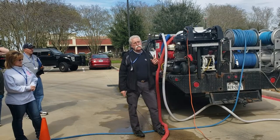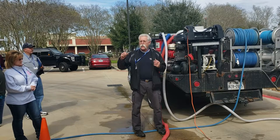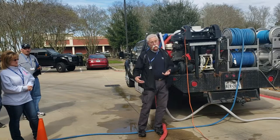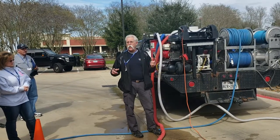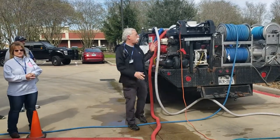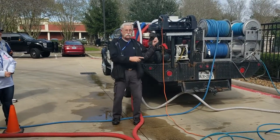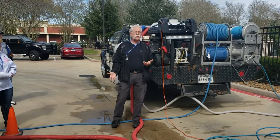There are situations where you want to suck water uphill — maybe drop a hose into an elevator shaft and suck water out. That's suction lift, and the harder you make that vacuum suck, the harder the pump out has to work. So there are times when you might want to take your auto pump out tank and put it down on the ground, because that's 4 to 6 feet of lift it doesn't have to additionally do.